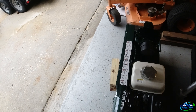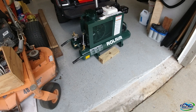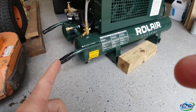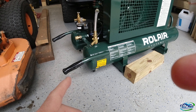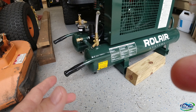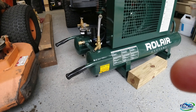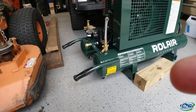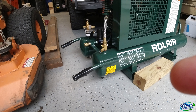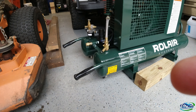The only other thing I'd like to do on the compressor — because of where the compressor is going to be located, I'm not going to have the easiest access to the drain valves on each side of each tank. What I'm thinking is putting a hose on each one — three or four foot hose — somewhere accessible: open that valve, crank it up, let it run for a bit, close the valves up, build up the air pressure, and roll with it. I got to take one of them out and bring it to the hardware store to find the right hose size.